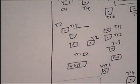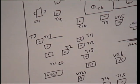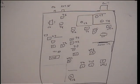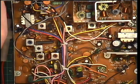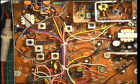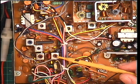Now I've already worked out what we're hopefully doing from the circuit diagram. I could look at my notes from the Harvard Good Buddy because it's the same chassis. And well, I'll do it from scratch instead. So we know the synthesizer's in lock and VCO is coil 2. So if we'd got snags with the VCO, we'd have to start thinking of some procedure to set that up.